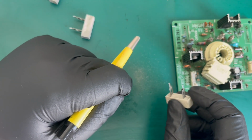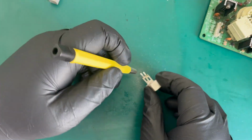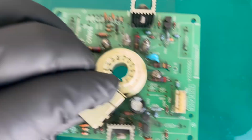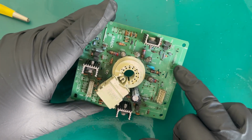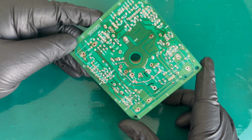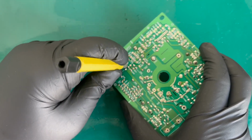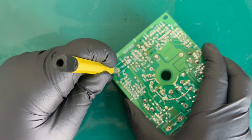The fiberglass stuff, you don't want to get that in your skin, so have a wet wipe to wipe all that up. And back with you in a second. Okay, and then looking back at the pads here, we can see that it's a good job they did fall out. There's a little bit of dirt on the board here, which I can just clean off. And if we look at the pads underneath, again, they look really good. But we'll just do the standard, give it a quick go with fiberglass. It's just to get rid of any oxidization that's on the pad, so that when it comes to resoldering, hopefully it will adhere really well.